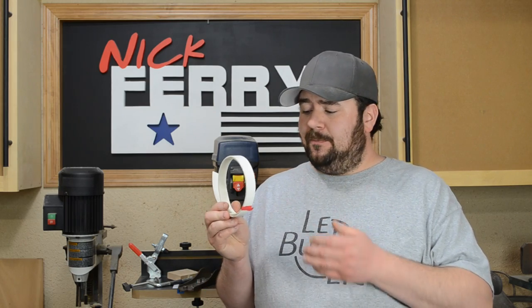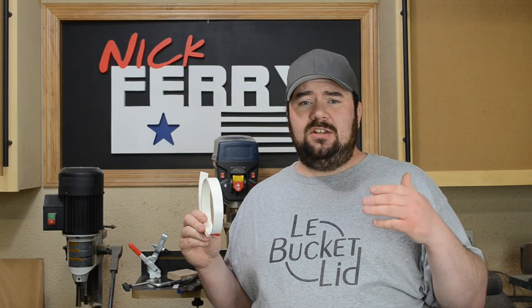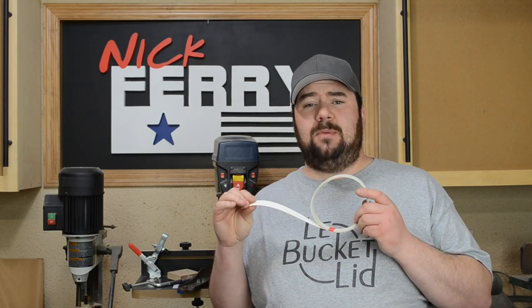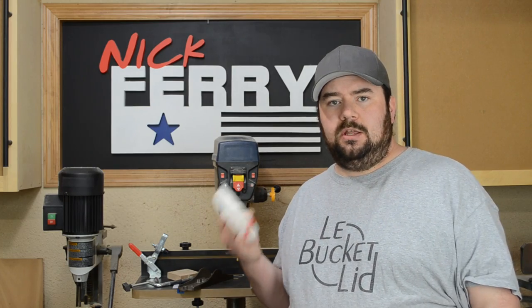Jeremy McMahon came up with a really awesome idea in the comments section of that video. He said to put white melamine edge banding — whether it's the self-adhesive kind or the iron-on kind — on one of the edges of that sandpaper cabinet, and that way with an indelible marker you can just write whatever grit sandpaper it is for each particular slot. If it changes, you can use mineral spirits or lacquer thinner to wipe off the marker and write back in. That is an awesome idea. I would have loved to do it while it was still disassembled at the table saw — I would have edge banded it, ripped it to final width to match the other side, and it would have been cut out along with all the dados for the shelves. That was a really cool idea and I wanted to thank Jeremy for that.